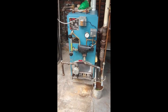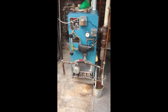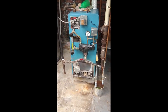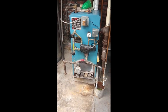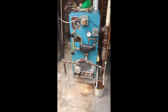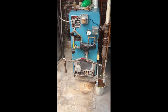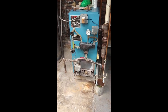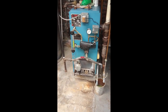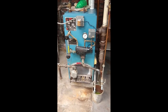Here's the final result. I filled it with water with the thermostat on, calling for heat. When the water reached just the bottom of the level of the sight glass, the float was starting to come up, I closed the circuit, turned on the gas valve, and boom — flame under the rack. Then I turned off the water and drained out half a gallon, and the flame turned off again. So the switch is back to working, and now the water is filled to the appropriate height — about two-thirds of the way up on the sight glass. The boiler's burning away.